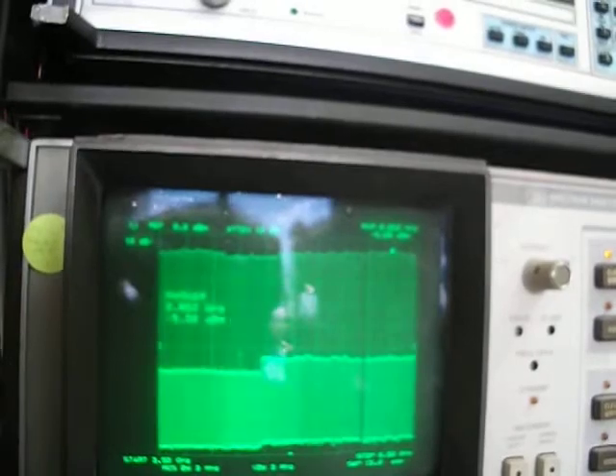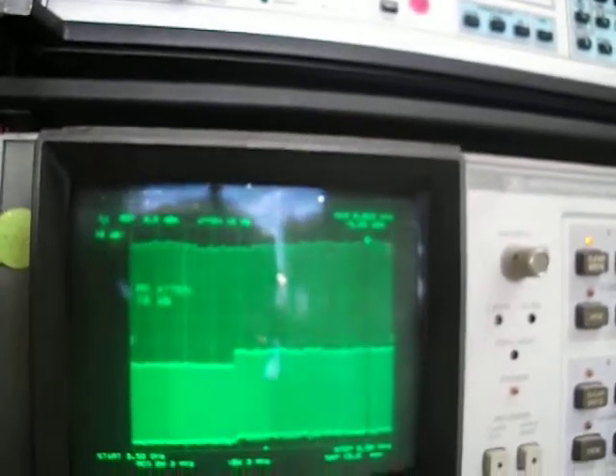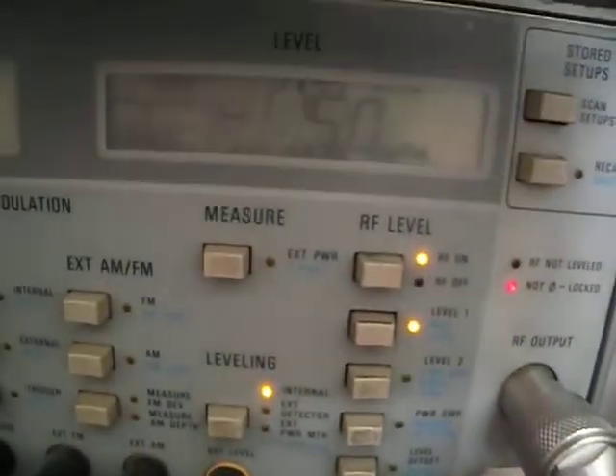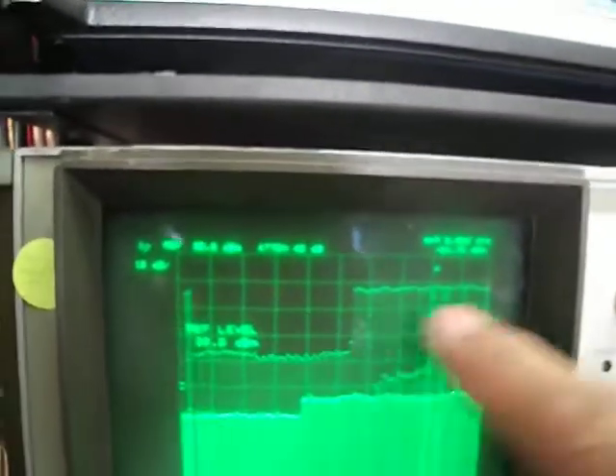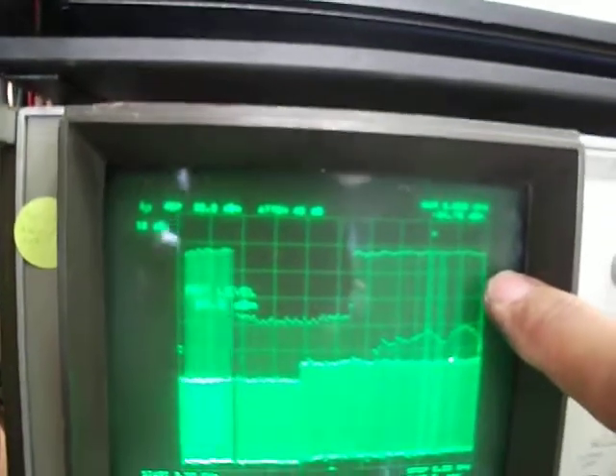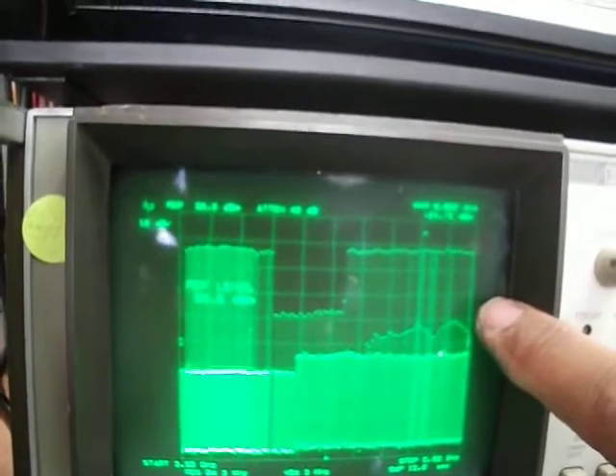Now let's see the power output across the range. I'll add the attenuator on the spectrum analyzer and take the reference level down, then push the output. We expect 30 dBm output, so I'll push the input up to minus 5 dBm. Here is the new power output — I'll wait for the scan to complete, then measure, and maybe push it a little bit higher.